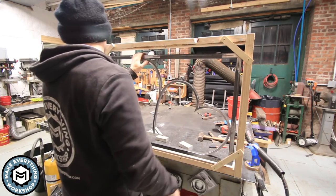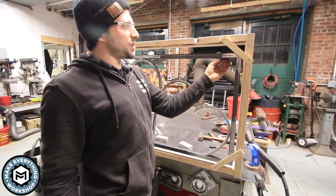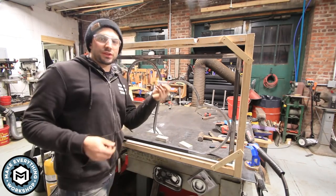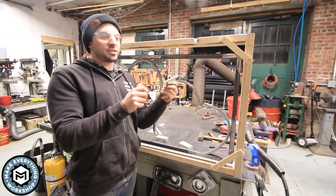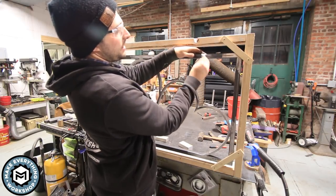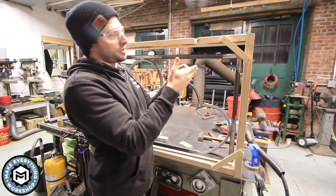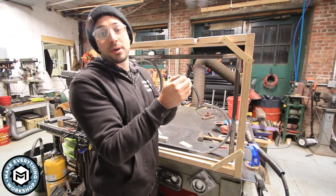So I have this spring pin that I can either weld onto this or screw onto it, or there's gonna be a teak cap put on this thing so it could even get screwed into the teak cap. But I'm gonna need to make some sort of a strike plate for it. So this is the spring pin that I'm talking about, and what'd be nice about this is it's super low profile, it's zinc plated, so it should actually last, and I can just basically put this on the gate on the back side, if you can imagine like that, and then if I create a strike plate with a long strike, this will actually recess as it goes into the closed position and then pop into the hole. So that should be a pretty quick and easy thing to fab up.